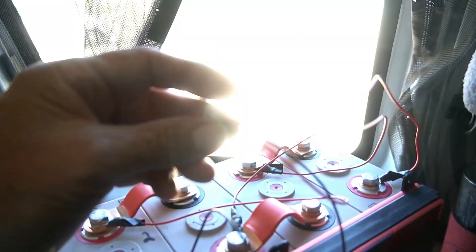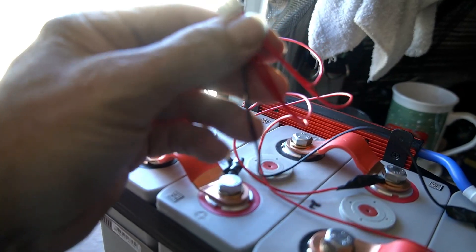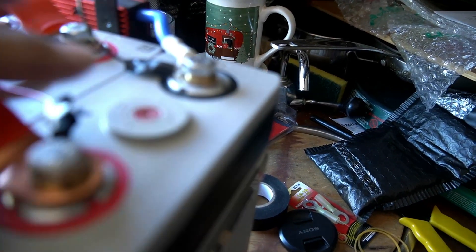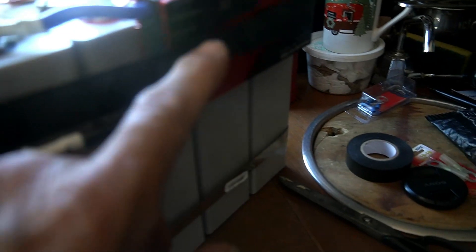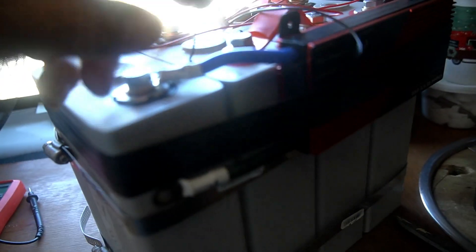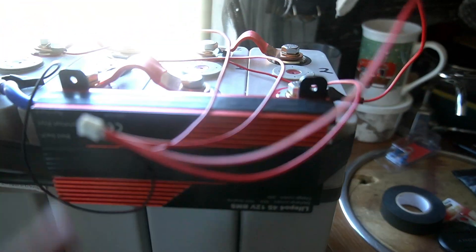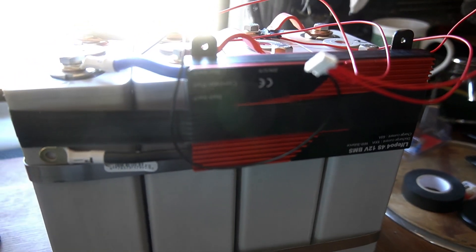What I've done now is hooked up all the wiring for the BMS — there's one black and then four reds positive. This is the main negative and has no other connections, it's not part of the series. I put the B-negative from the BMS here to this, then the black wire, and then I take each successive wire and put it on positive, positive, positive, positive. This will plug in once I get the batteries in the back, just before I wire everything together — and then you'll have your BMS connected for a 100 amp hour lithium iron phosphate battery.